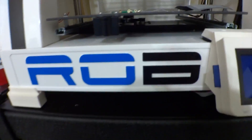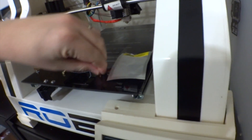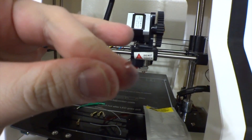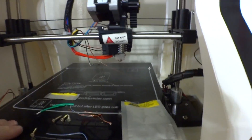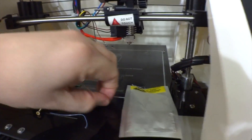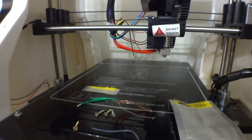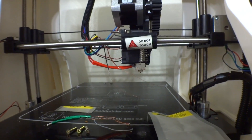I'm waiting for John to get back to me with a couple of other parts, so I'm going to work on the Robo 3D here. I've got a new thermistor — this is the little piece that measures the temperature of the print head while it's printing, and the other one I accidentally broke off. I've got to put some heat shrink tubing on it to protect the wires so they don't touch each other, and then I've just got to solder it up and cement it back on there and we should be good to go.